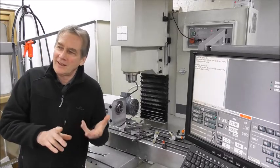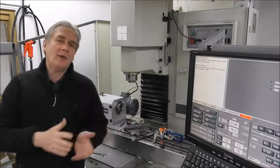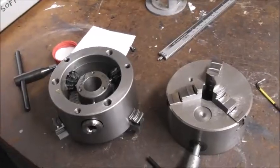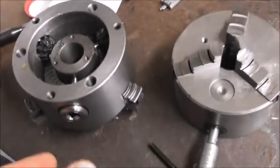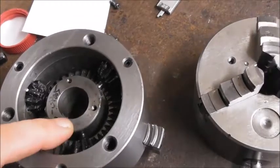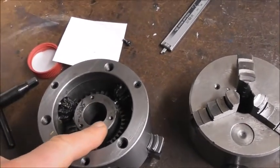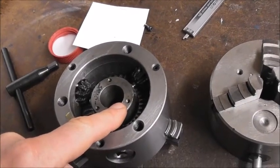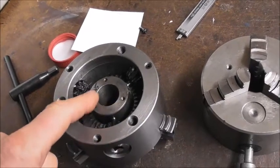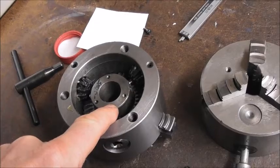If you've got any thoughts or comments or warnings on that, they'd be most welcome. I'm going to have to shift the coolant possibly to this side, and I'm just going to mull it over for a few days because I want to get the best format I can. I'm also looking at improving the capacity of this little 4-inch chuck. I've got about 5mm of pinion bearing penetration into that inner section, and that section is 9mm. So I could bore 4mm out of the radius — that's 8mm out of the ID — which would take it up from 22mm to 30mm. That's quite a big boost in capacity. I would have to reposition those threaded holes if I went to that maximum amount, but it's probably worth doing.